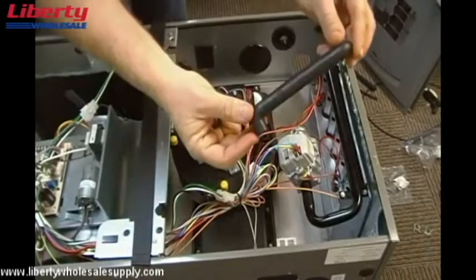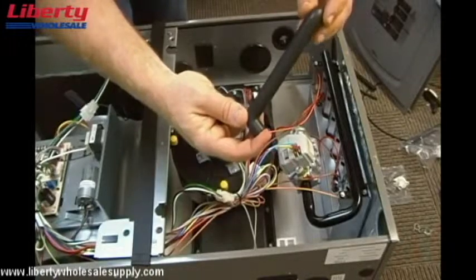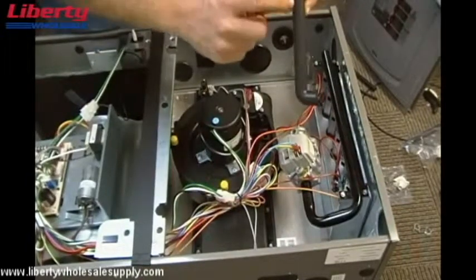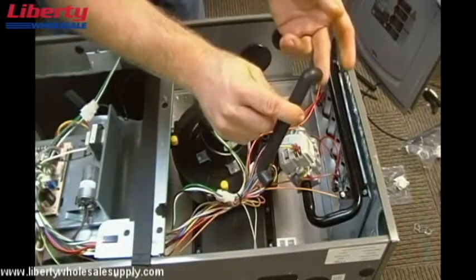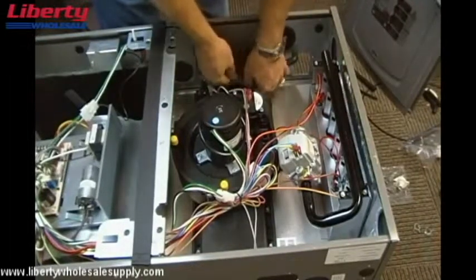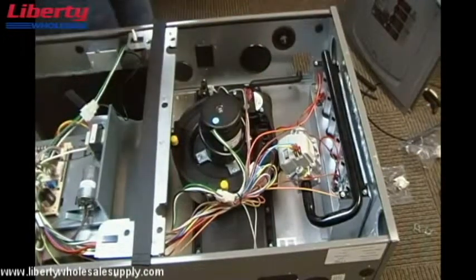The next step is to take hose G which comes in the RXGY-CK kit — that's the zero clearance for horizontal left with right vent. Take that hose; you'll see that it has an embossed trap with an arrow pointed out, meaning the trap is connected to this end, so this end goes on the collector box. We recommend soapy water to get an easy connection. Once you have that connected, just leave it there until you go to the next step.